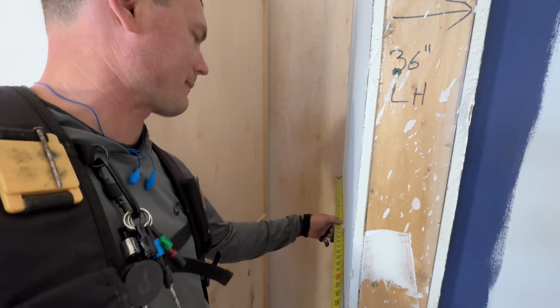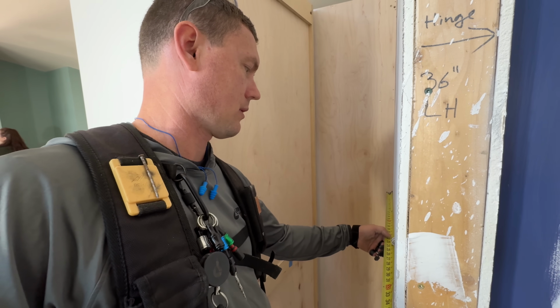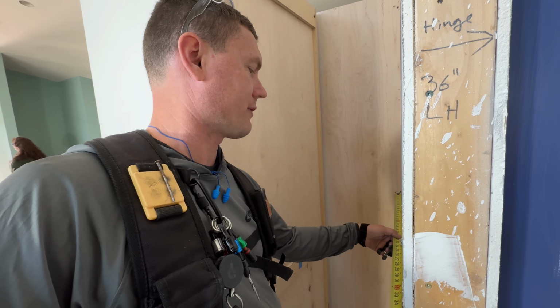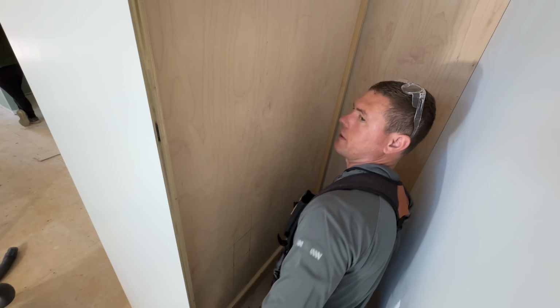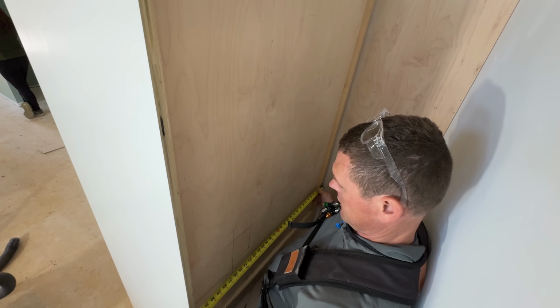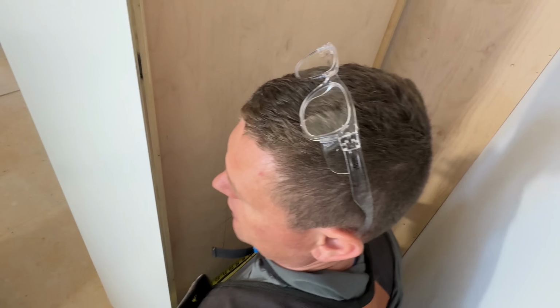All right, then. I'm going for a half inch oversized, so the plate will go on the drywall. It'll go tight to the drywall. 22.5, 25.5. And that's flush, right? Yeah, it's all flush, no face frames. Usually used to having to account for a difference there. And the sides are 3/4. 22.5, 25.5. I mean, that checks out.